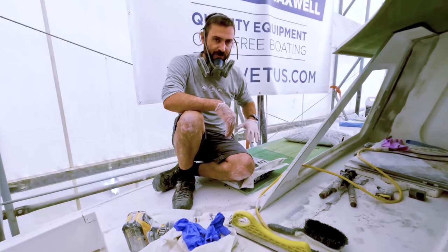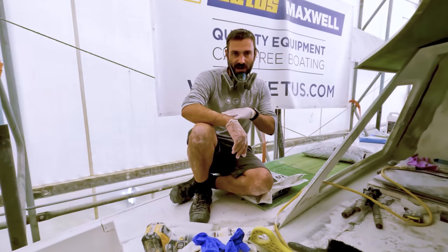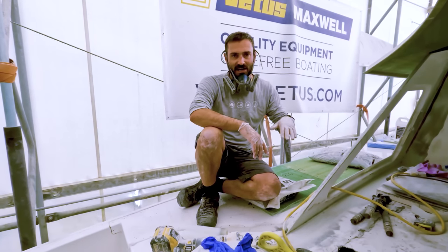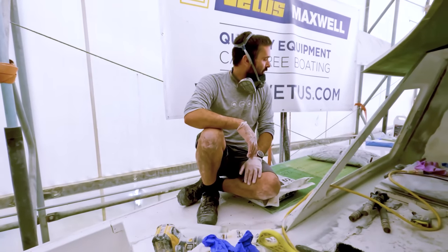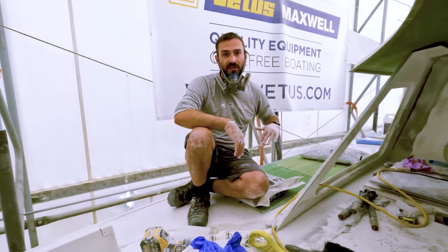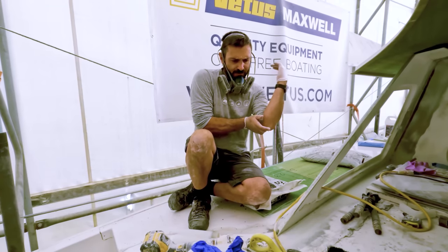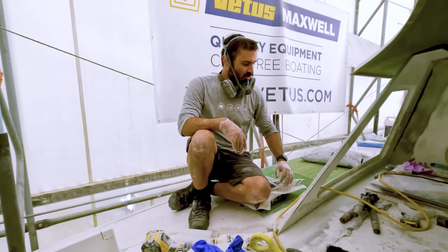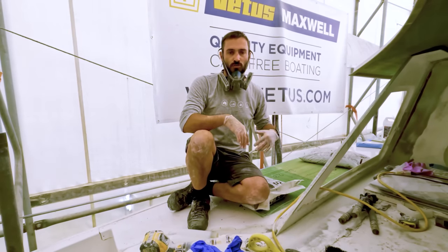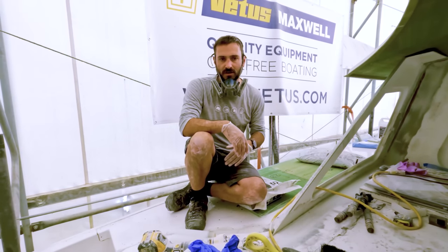There were two different surfaces we were bonding to: the exposed foam and then the edges, which were solid fiberglass. The methacrylate is making it into a solid fiberglass section through there. We laid interior fiberglass pieces and bent those to follow the curve of the deck, holding the hatch pieces completely flushed. We're going to have foam on this deck as our non-skid, so only the first inch around the hatch needs to be perfect — everything else gets glassed in, faired in, and should look great.